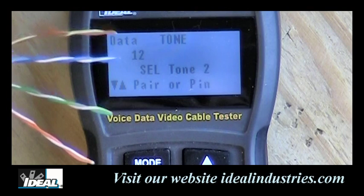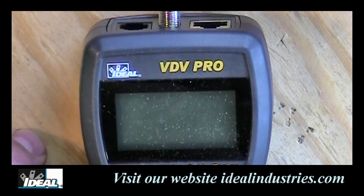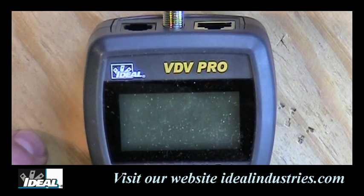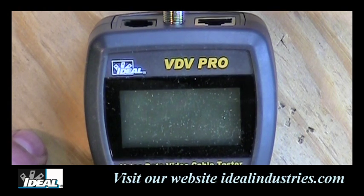And now let's talk about the hub blinking feature of the tester. Now, if you're going to use the hub blinking feature of the VDV Pro, it's pretty simple to use. And we'll use it for when we're trying to identify a cable in a room someplace. We'll plug the VDV Pro into the outlet in a room, put it in its hub blinking mode, and then we can identify which port on a hub or a switch it might be tied into.